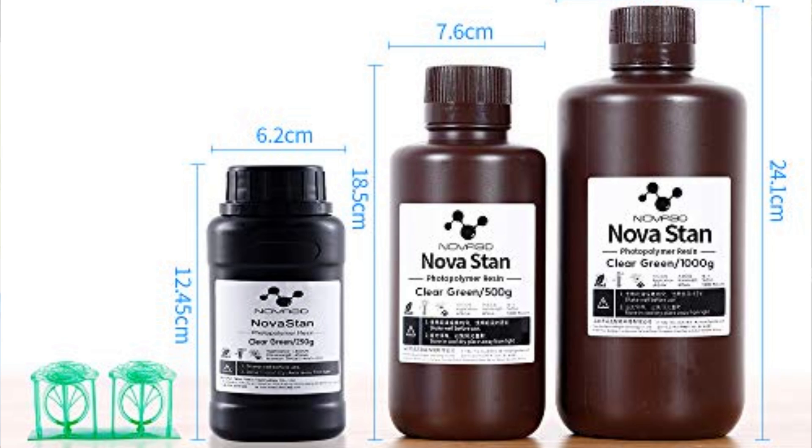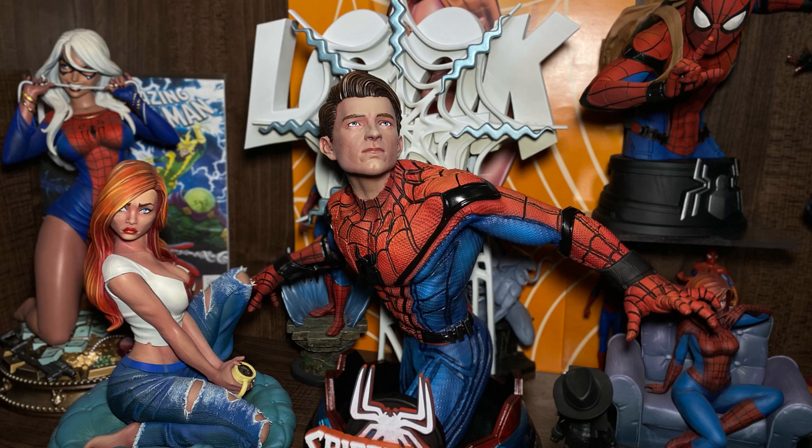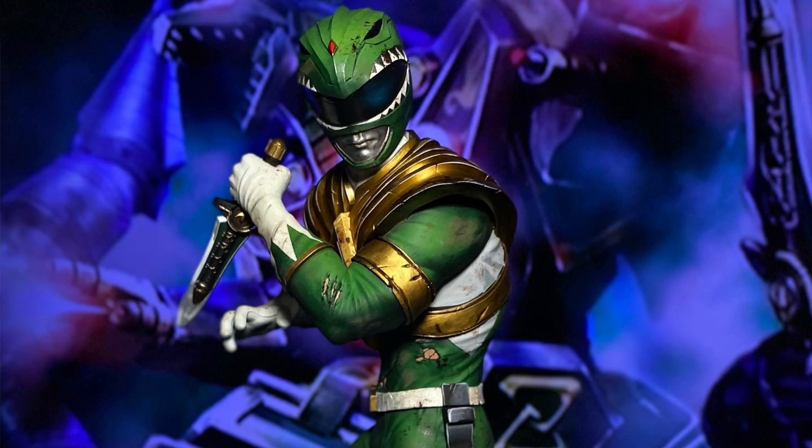Let's go on to resin. Resin comes in multiple types of material. You get standard types, water washable types, flexible ones, and wax-like resins. Standard resin, generally in grey, tends to hold a lot better detail, and this is the kind most modelers would use based on its detail-holding capabilities. Water washable resin was created to be more environmentally friendly; however, up till now, a lot of people have had quite a few failures with water washable resins.